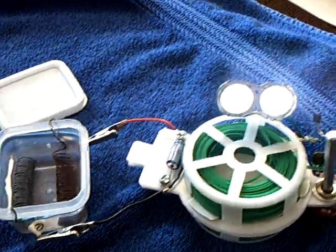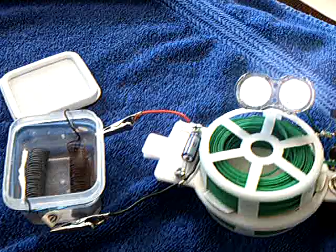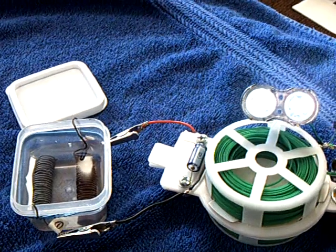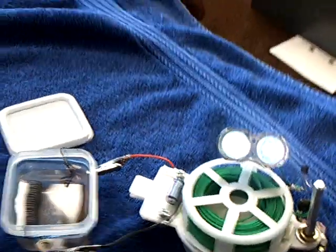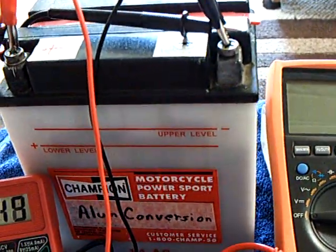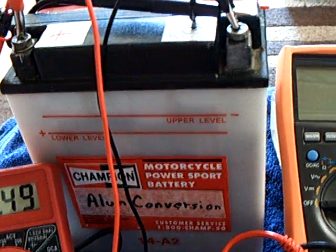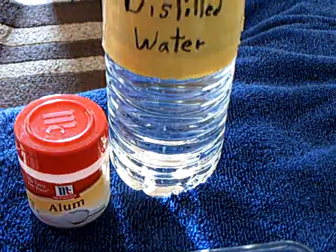I had such good luck with this lead-alum solder rechargeable battery that I built, so I decided to go a little further with the project and convert a small motorcycle battery that was basically dead to the alum and distilled water. I took this motorcycle battery that had been sitting in my dad's backyard for a couple of years — it was dry, nothing liquid in it. It still had about 5 volts in a dry state, so I thought I might be able to bring it back by converting it to the alum and distilled water, this pickling alum — aluminum sulfate. And I was able to get it back.